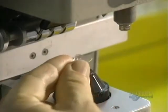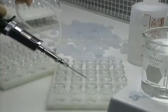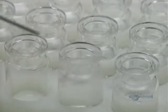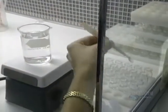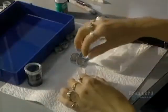This unit, called a frontofocometer, is a metering device which verifies the optical precision of the lens. Lenses are now completed and are cleaned, and they're stored in containers filled with a salt solution. This little vial that we find at optometrists is perfectly sealed with a silicone cap and another of aluminum.